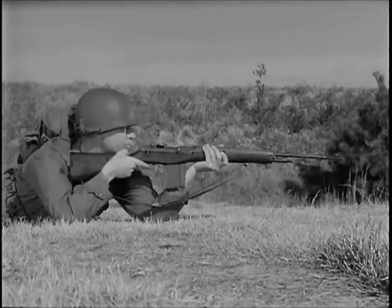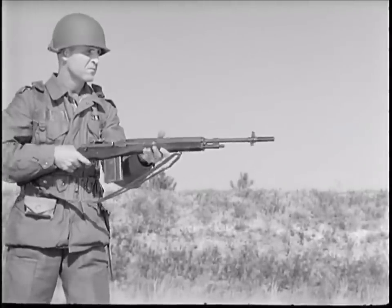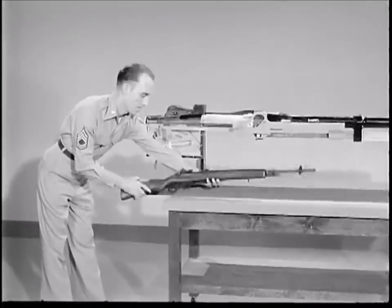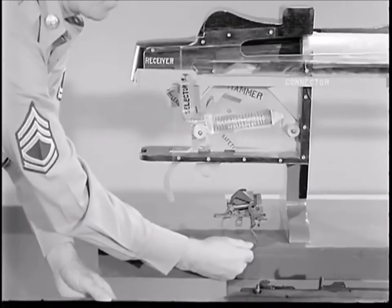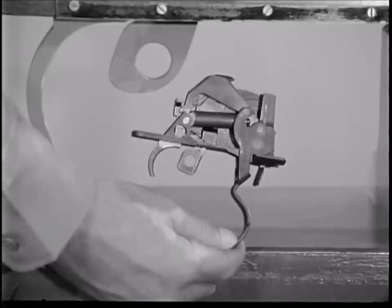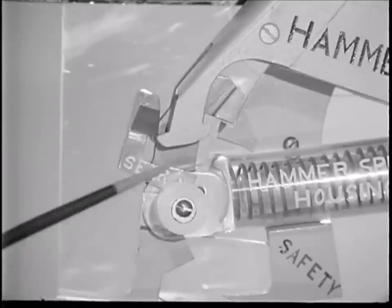The cycle of functioning we have demonstrated is the same whether firing is semi-automatic or full automatic. In full automatic fire, cartridges are fired continuously as long as the trigger is held to the rear. To see how the mechanism can be adjusted to fire either single shots or bursts, we will use an oversized model. If the firing mechanism assembly were operating at normal speed, recoil would happen so fast that no rifleman firing single shots would have time to release the trigger in preparation for the next single shot. To overcome that, the sear is provided.